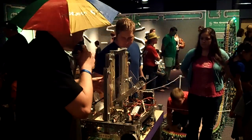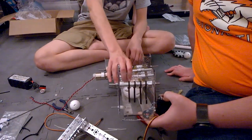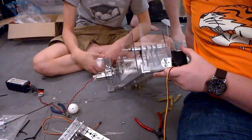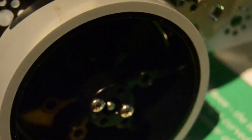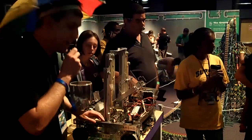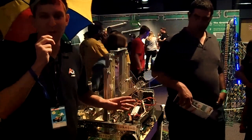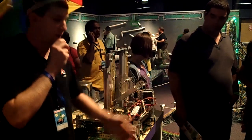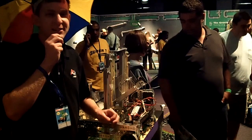We had jamming with this mechanism — one of the holes was drilled in the center structure not quite high enough. If you do that, we'd advise using a thicker polycord to give a little more flex. Another problem was that we just ran out of lock nuts. We highly advise teams to use nylon lock nuts to keep the robot nice and sturdy. You saw at the end of our reveal video that a wheel fell off — the very first time it came off the ramp and drove around, the wheel fell off. We ran out of collars and lock nuts. Use lock nuts or Loctite to keep your robot sturdy.